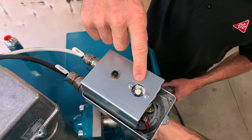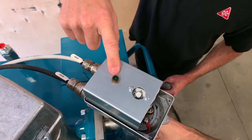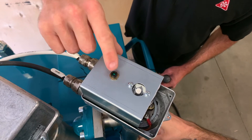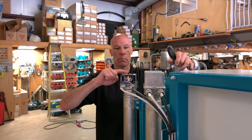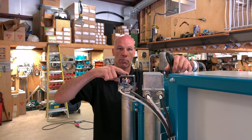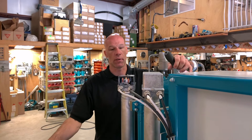The cycling thermostat is the one with the dial, located closest to me, and the high temp cutout thermostat is the one with the raised portion. When it trips, you'll see a button pop up from the center of it, and to reset it you just push the button down — that resets the heater and you'll be ready to operate again.